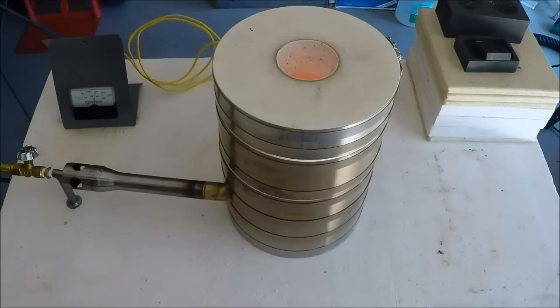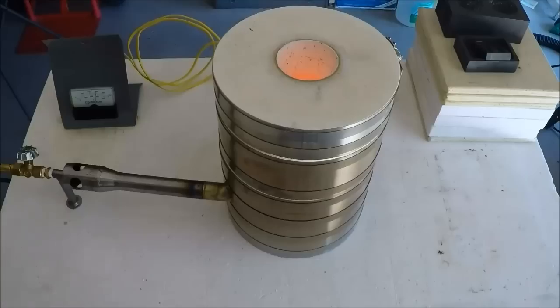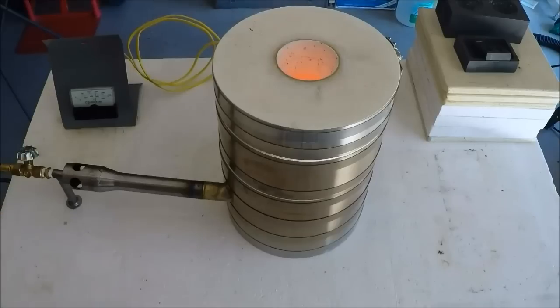We're inside the garage right now and that's not the place to do the demo. When the sun goes down a little bit I'm going to wheel it out in front, and once it gets to dusk we'll go ahead and melt some silver and pour some silver. So there's your kiln sitting in idle mode — your pyrometer is reading 1500 degrees, you have a flame coming out of the top about 4 inches tall, and your burner is cool, not even hot.